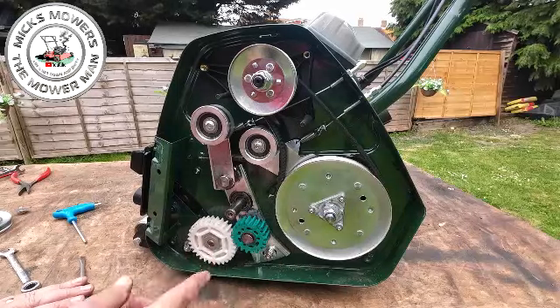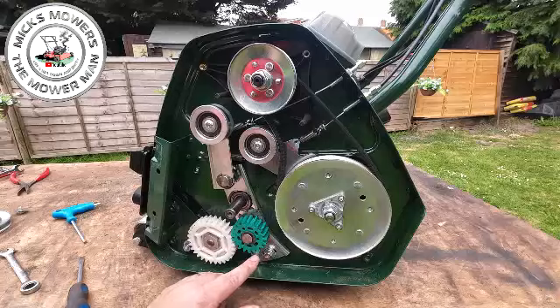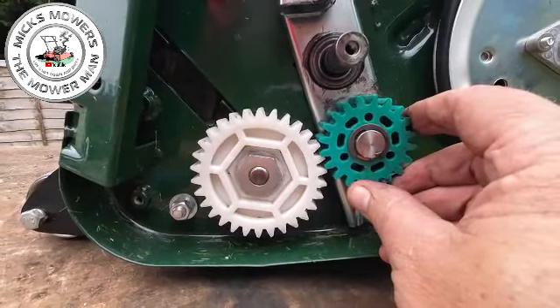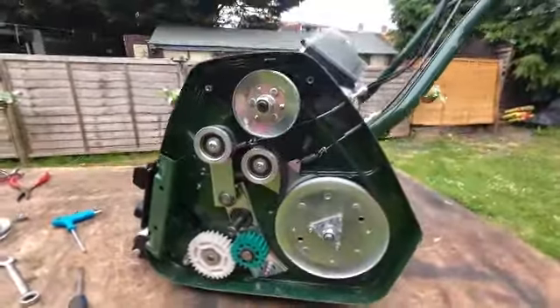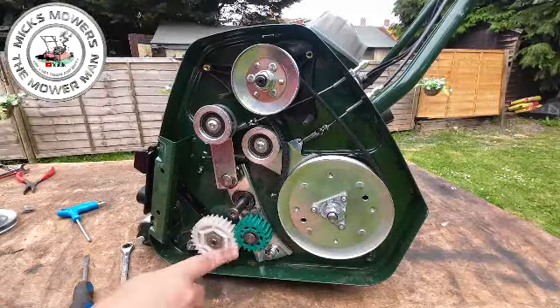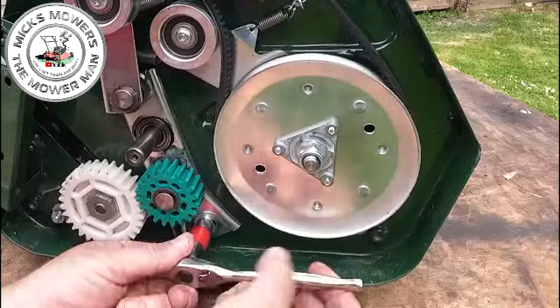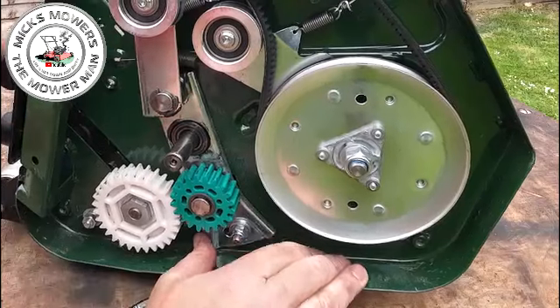This intermediate gear here is a little bit different. One reason you might have lost your cylinder drive - not a lot of people know about - is there's another little bolt all the way down here. These two gears need to mesh together and as you can see they are just slightly meshing but there's a lot of slack - it could do with a little bit of fine adjustment. We're going to adjust that before we remove the gear. If you lose your cylinder it may be that your gears are good but this white cylinder gear is not moving because these two gears are not close enough together.